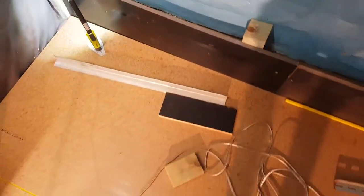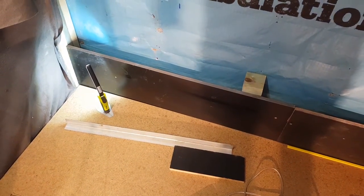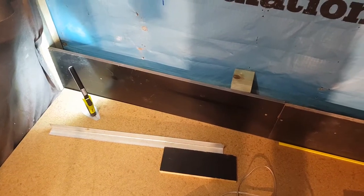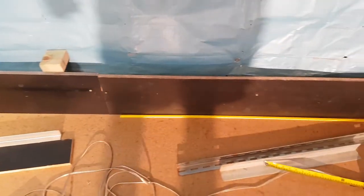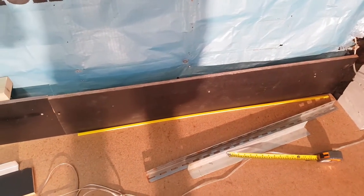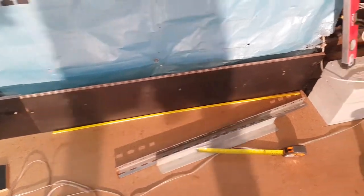It's just in that corner there. So I'll be peeling this back and seeing if I can prop that up and make it solid, as well as pulling these two pieces of timber apart. I was thinking about even throwing a bit of this yellow tongue beading in between. And yes, that won't make that noise for sure. But that's the only part that's squeaking.